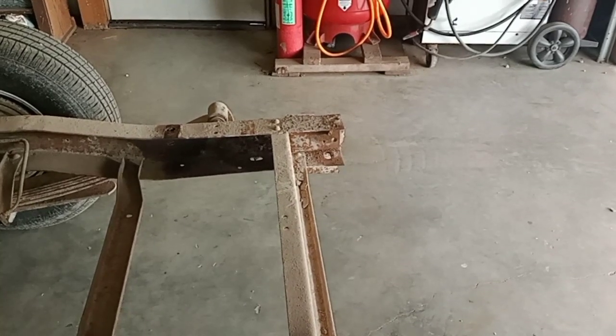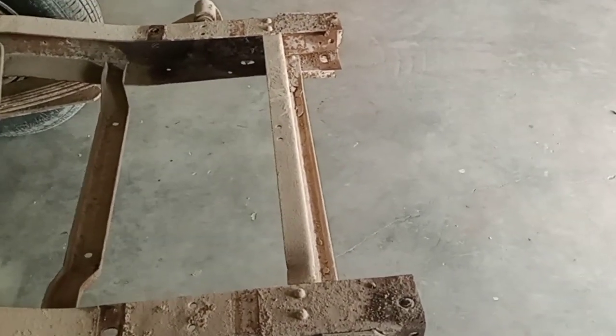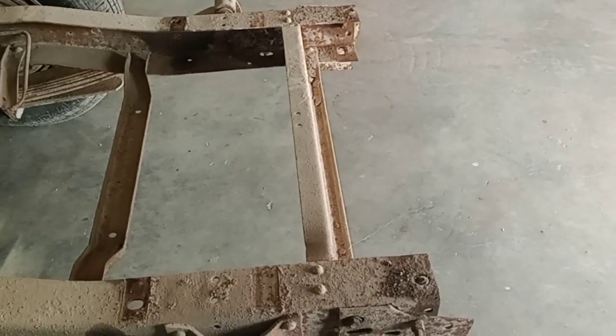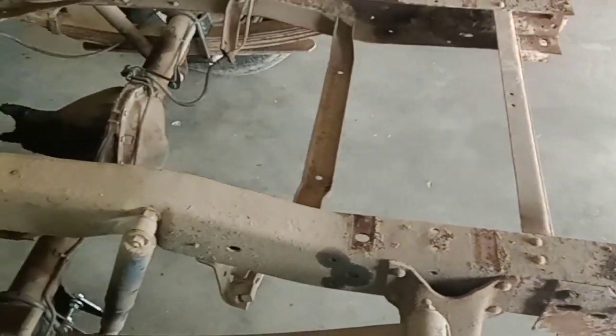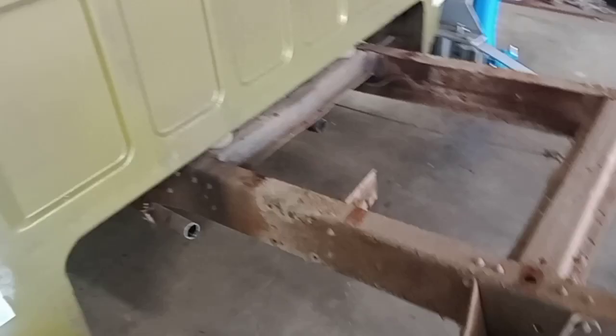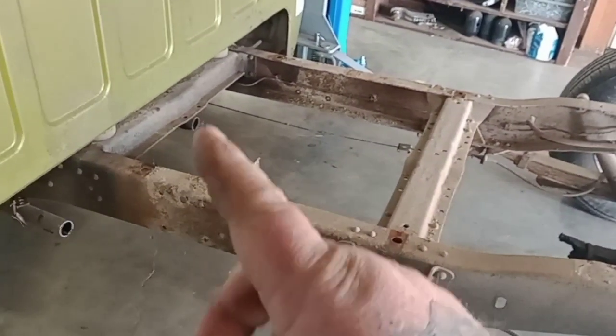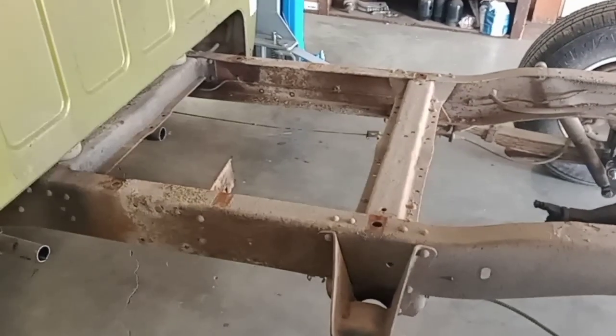I like five and three-quarter inches — it's about five and seven-eighths between the holes on some trucks, some are right on six, they're all about the same, stamped from the factory. But 14 inches off the front — we will not be doing a straight cut on these frames. I do not like straight or angle cuts; we will be doing a Z cut and I'll show you how I lay that out.